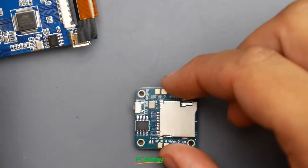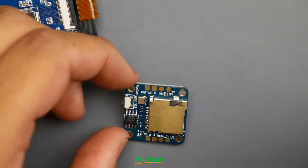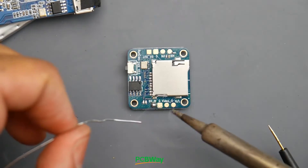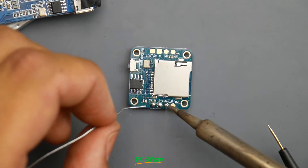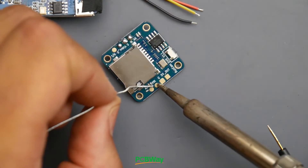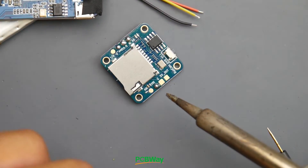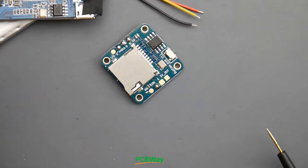The next step is we need the DVR here. Now, this is very important because not everything is going to go on one side. So what we're going to need here is obviously ground, the video in, and the 5 volt in. Very important — 5 volt in here. So here's the 5 volt in, here's the ground. This one is video out, but that's not what we need. We need video in, which is this one — VIN right here. And there's also audio — if you wanted to connect audio, you can totally connect audio. I'll show you which one outputs audio on the receiver, and you can even modify this to bring you audio if you wanted to.